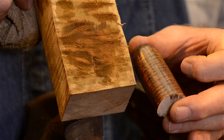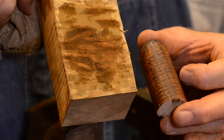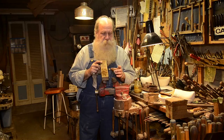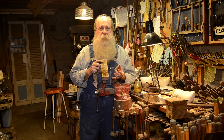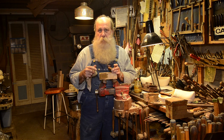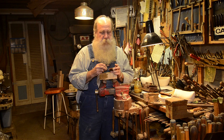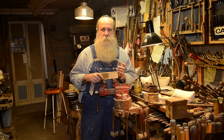The dark spot is the softer grain, and the bright spots are the harder grain. So when you're scraping along here, you'll get this washboard effect out of it, and that will impart another feeling to the wood. So like on a rifle, you prefer to have that washboard, that early style of scraped and burnished finish, instead of a glossy, high sheen, sanded finish with steel wool or something like that. I prefer a scraped and finished surface, and ferric nitrate is my stain of choice.